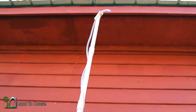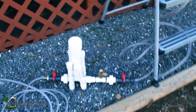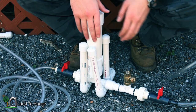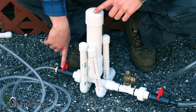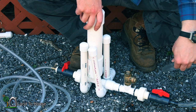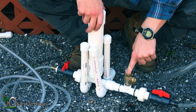The vertical is what really affects how the pump operates. In this example, I've got a 10 foot pipe acting as my hill for this delivery pipe to climb. Let's get this pump operating. For the first use, the pressure tank is empty — there's no water, no pressure in it. So we're going to keep the delivery pipe closed and turn on the drive pipe. There is still air inside the drive pipe, so I'm going to purge that by holding the valve open.